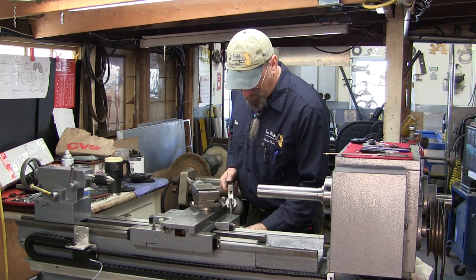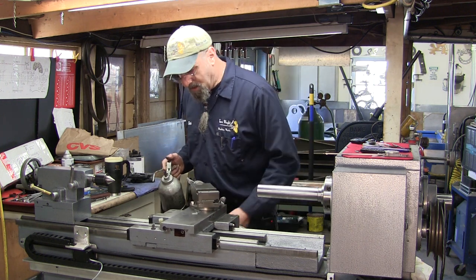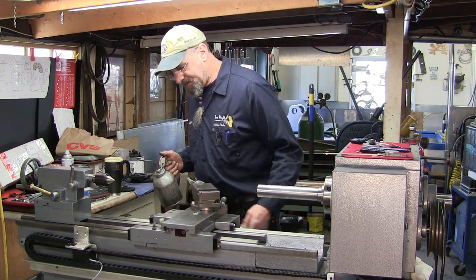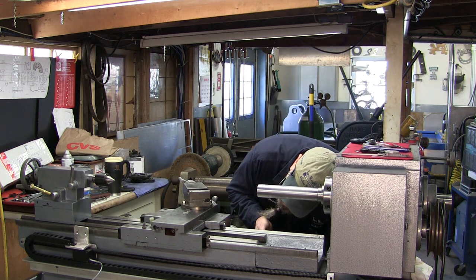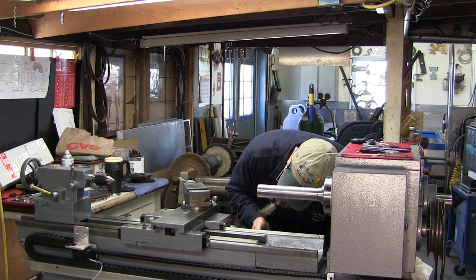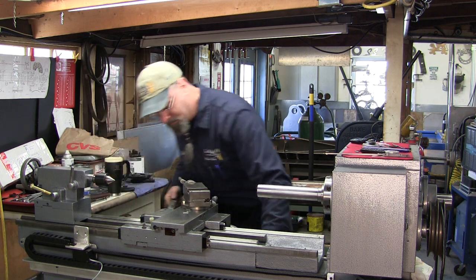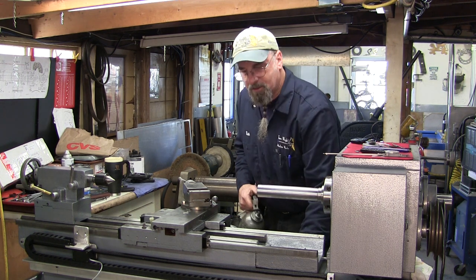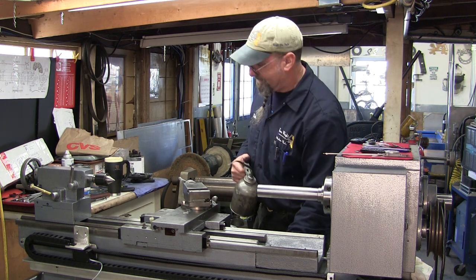We actually have an oiler down here on this hand wheel. We might incorporate that in the auto oiler as well. Okay, and one thing that we do want to do is get in here and squirt a little oil on that worm gear right now. Put a little bit in from each side if we can get to it from this side here. Nope, it's all pretty much from the front side here. There's a little trough there, and it can ride down in the oil. All right.